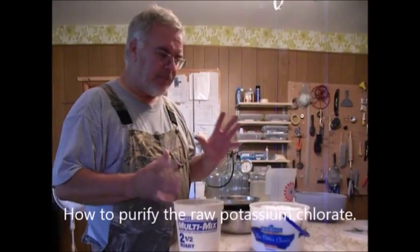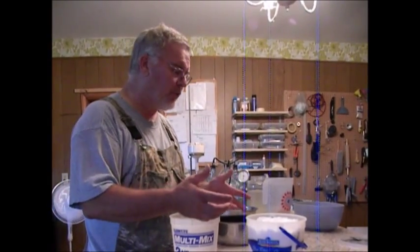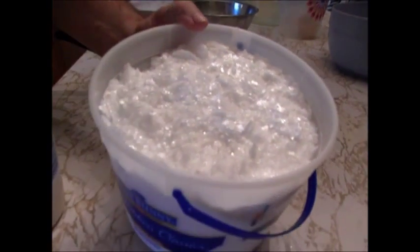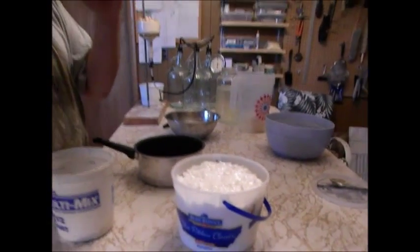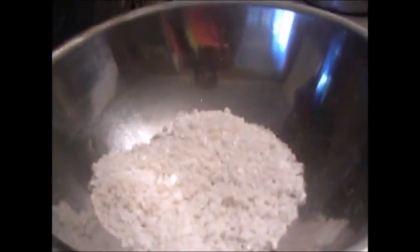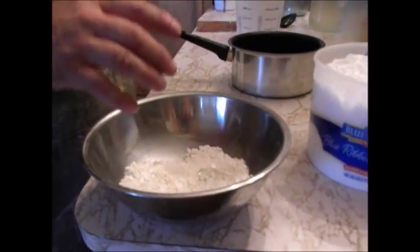I wanted to talk a little bit about two types of products you get when you take it out of the cell. When you hot filter it and let it cool down, you're going to end up with a bunch of flakes — just nice white, looks like snow, really does, just little white crystals. Depending on how long you let your cell run, the longer you run it, the solution becomes too saturated and you can't hold it all in suspension. So in the bottom you're going to start to get little chunks that look just like salt. These we need to run back through a hot solution and liquefy in order to turn them back into flakes.